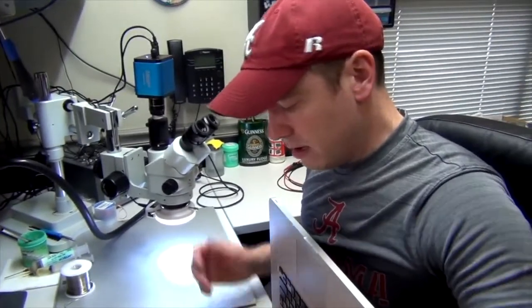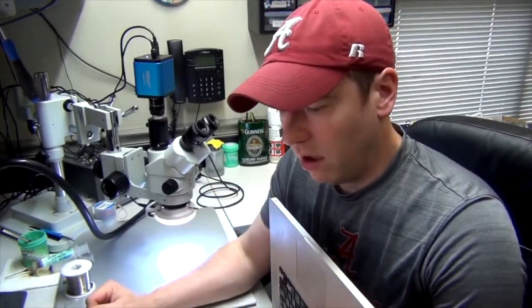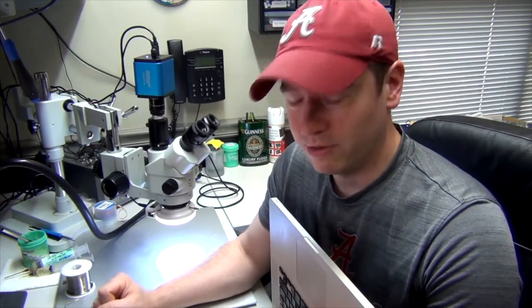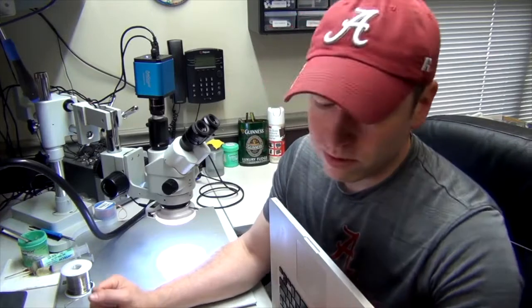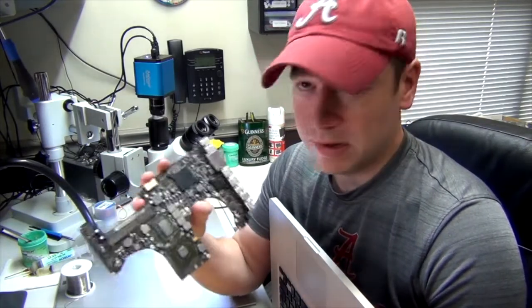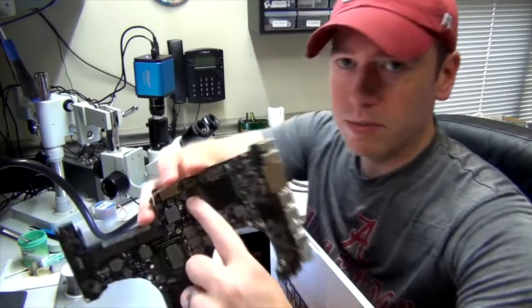So the issue is, it could be a couple different things. And this is kind of fun to do. Hopefully it's the easier side of the problem, because if it's not, it's going to be the SMC, which is not fun, and I'll show you the reason why if we get to that. Well, I'll go ahead and explain it to you. If it's the SMC, we can't order the replacement chips. We have to pull them from a board of the same kind. Here's the SMC right here,